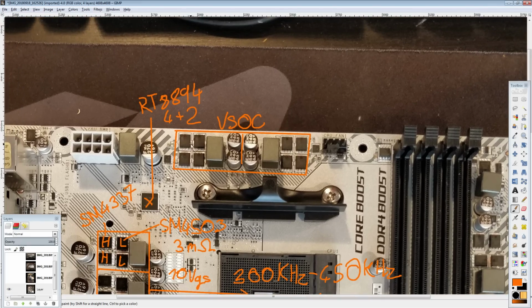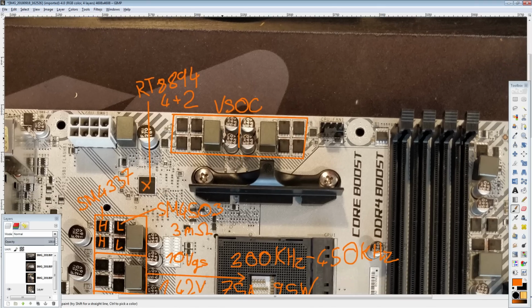basically all of your heat is going to be generated in these Mosfets, and then it's going to soak into the board, something like that. Or at least in theory, it should behave something like that. Depends on how the internal power planes are laid out, but there should be one giant ground plane somewhere in the board. So it would soak into that. And so basically, they're trying to sink as much of the heat from the VRM into the board itself, and that's why they have the Mosfets as far apart as possible.